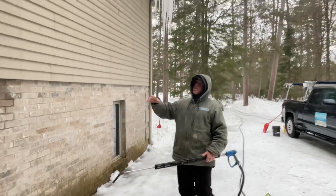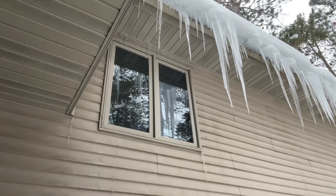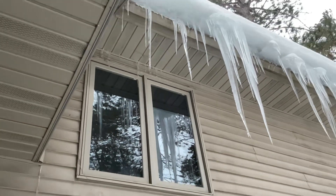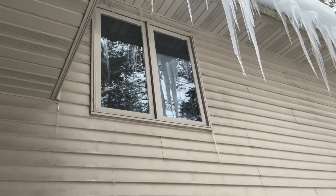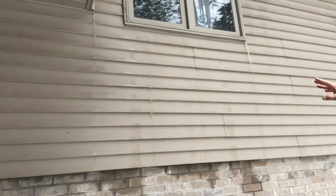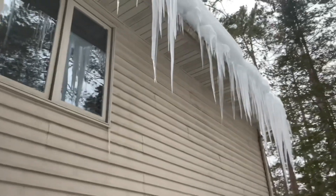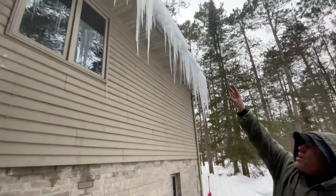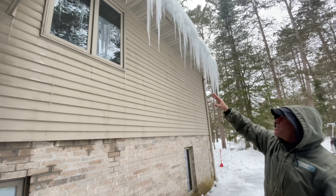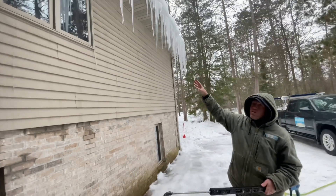We were called to this job because they had water coming in the building. As you can see here on the siding, we've got some ice coming down right above the window, right through this office, right down the siding. We've got some ice right here on the building. These are great indications that the ice dam on the roof is actually holding water. The water comes underneath the shingles, fills up your soffits — your soffits basically become a solid block of ice — and then you start getting water in your building. This area right here actually isn't leaking inside yet, but I would say there's probably water in the wall cavity.